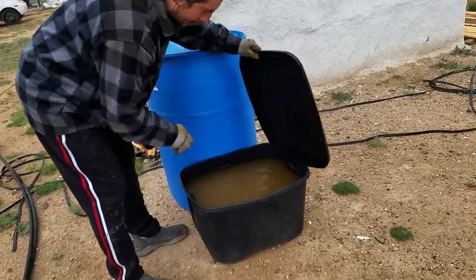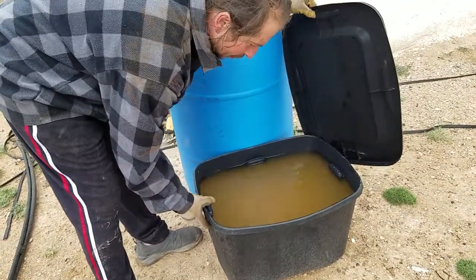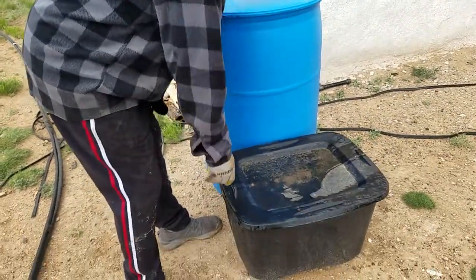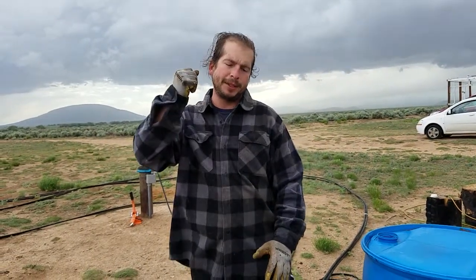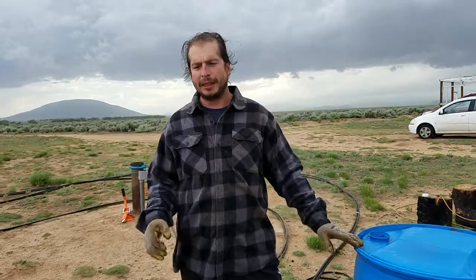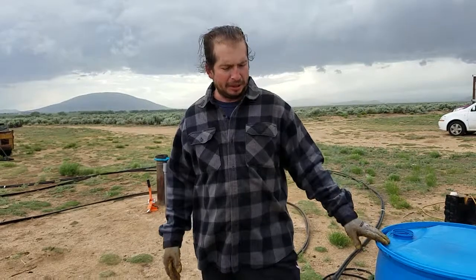I haven't looked to see, so there might have been some dirt in the bottom. I think it'll be just fine. That's all the way down at 392 feet. I pulled out as much sediment that was real thick and gunky, got it down to where it's just real light. And so it'll be about roughly 40 feet from the bottom when I install it at 355 feet. So I shouldn't pull up any more gunky sediment — it should just be nice and clear water. I know when I pulled it up 10 feet and tried pumping, that water was all clear. So there must just be a very very little bit down on the bottom.